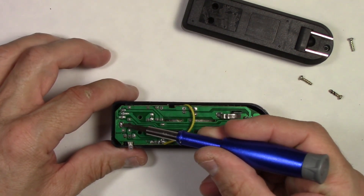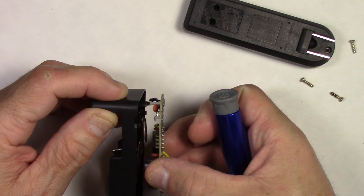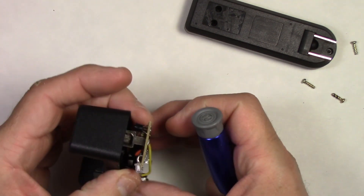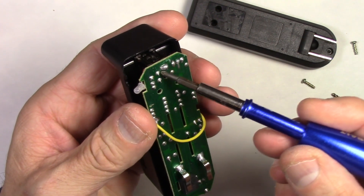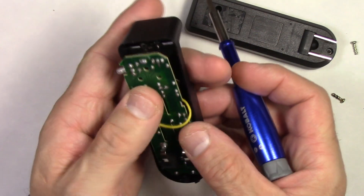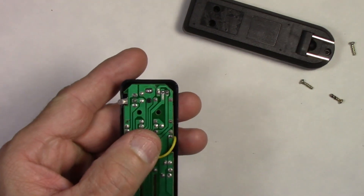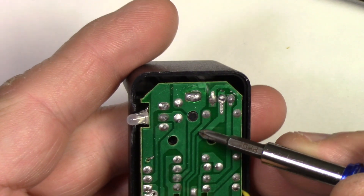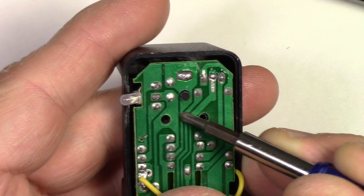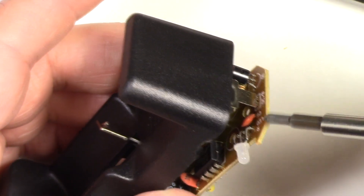The positive lead is this hole right here. Pull the circuit out — it comes apart quite easily. You can see the positive tab here, and it is connected through the board. What we need to do is take the trace that goes to that tab and isolate it from this circuit. I'm going to cut the trace right there. I can see there's a capacitor attached there that also needs to be removed from the circuit.